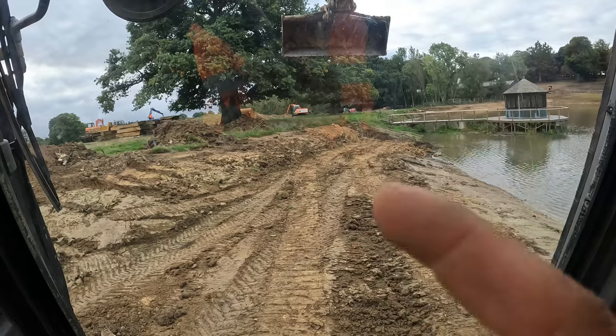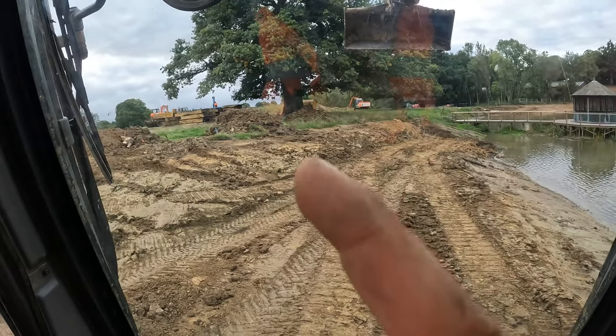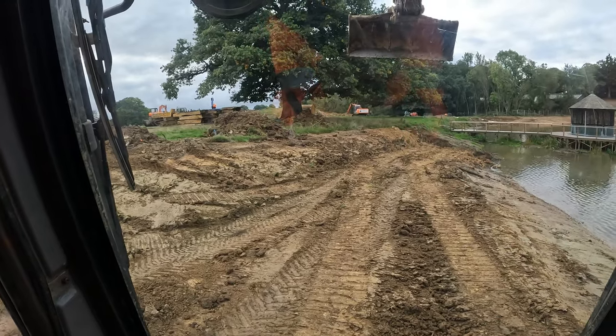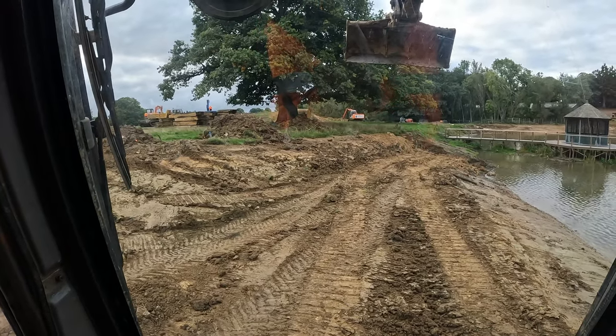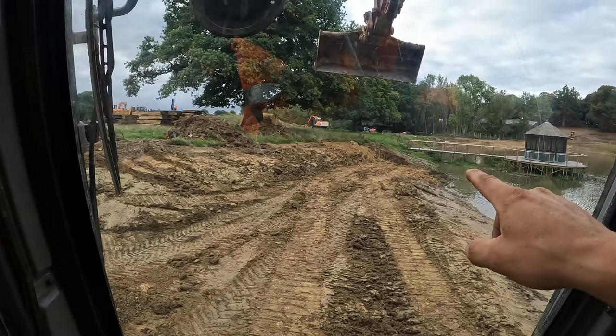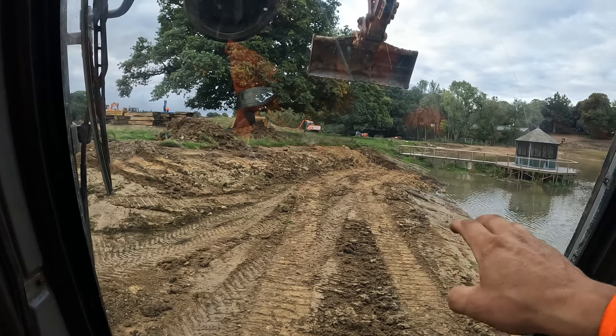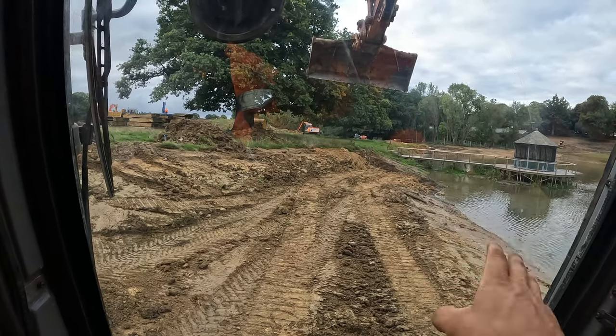First of all, I take the crap away. In this case, I just put it on the side. No topsoil or anything like it, or bad ground material. It has to be dug down. And basically, I start with the bottom. I make a flat base wide enough for the machine to go in, so I can track it in.